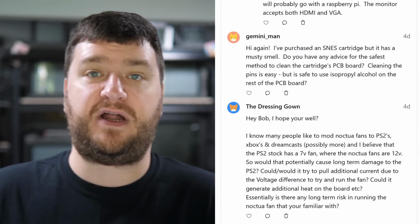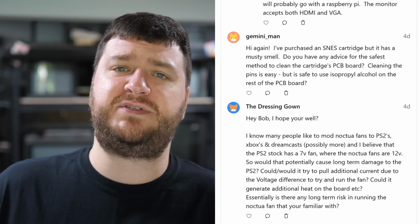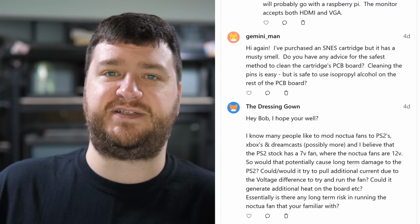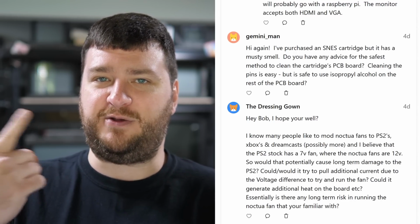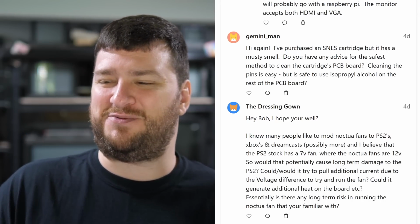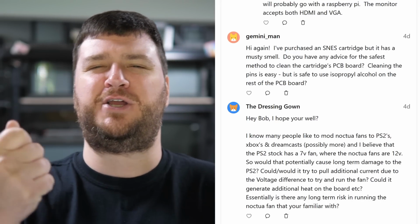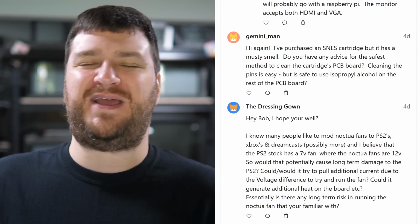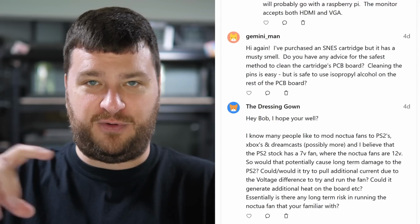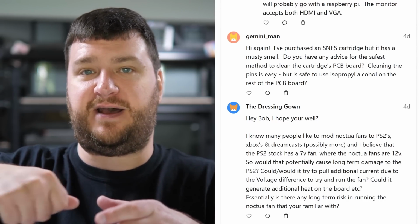And then I'll take an electronics brush. You could probably use a toothbrush, but I don't like it because some of those toothbrushes have coatings on them, and I also don't like that. It's my OCD. I don't like visualizing a toothbrush, because the next time I go to brush my teeth, half asleep, I'll be like, did I use this by accident? So I spend like $1 on a bag of electronics brushes, and I pour the alcohol over it, and I scrub the heck out of it.